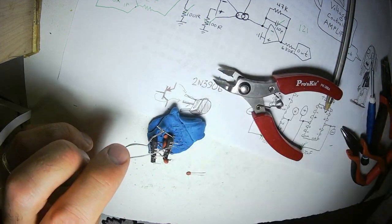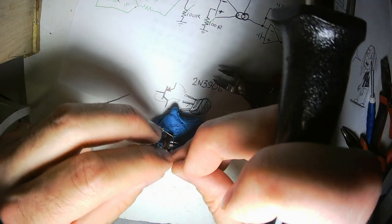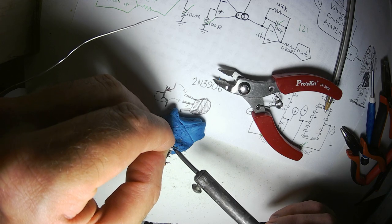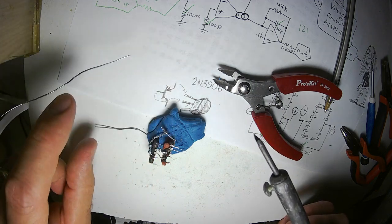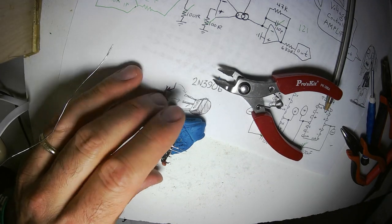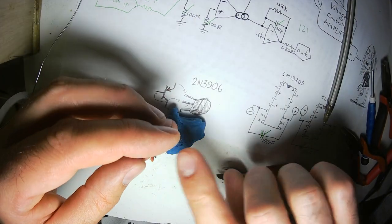So, I mean, obviously it works with other kinds of signals too. It'll fold up anything you put through it. It can be very cool when it is voltage controlled. You can get some cool sort of wobble bass sounds out of it. So that'll be one of my upcoming projects. Most of the Lockhart wave folders you find on the internet are not voltage controlled. You just control them with a potentiometer. But I will use one of these circuits to voltage control a Lockhart wave folder. Pretty cool, stay tuned.